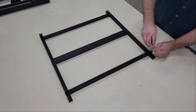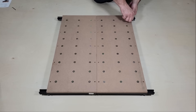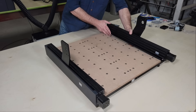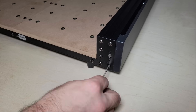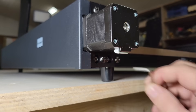The frame and rails seem strong enough for the job, but we'll see if they actually are later. The frame fastens together simply enough with a few bolts and a rubber leg mounted in each corner. My first and probably most obvious mistake in the rush to get this put together was putting the spoil boards on upside down, so the bolt heads were exposed. The Y-axis rails are all pre-assembled and just bolt to the frame with a few screws in the front and back. Then I fastened the X-axis motor in place before installing the gantry and Z-axis.